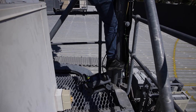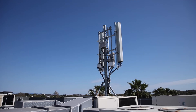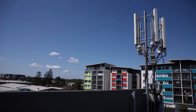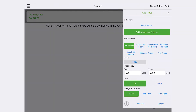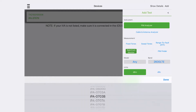Connect the test port of the RTF module to the antenna port to be tested. Prior to testing for PIM in the radio system, it is necessary to ensure external interferences are removed, or at least identified and recorded, to ensure these signals are not causing false suspected PIM sources.